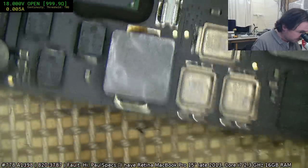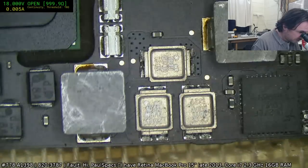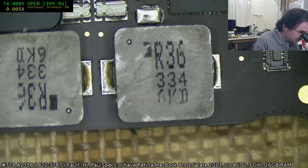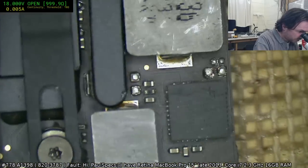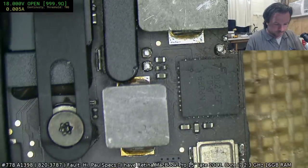Yeah, Mike, that could well be the VRMs then. And it's not necessarily when it's under load. Sometimes it's more when you're transitioning loads. So you go from, say, a high load scenario and you drop into a low load situation, then the VRM botches up and boom, it drops down.